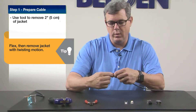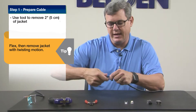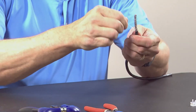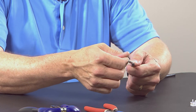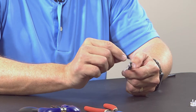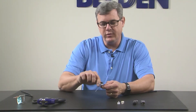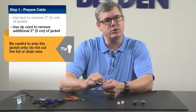You can then flex the cable and separate that jacket. It helps if you untwist the jacket, as that spiral wrap groove tends to grab hold of the jacket to slide it off the cable. With that out of the cable, we now want to use the RipCord. The RipCord will bring the jacket down to an open area where we haven't risked nicking the cable with the strip tool. To ease that process, take your snips and snip the jacket slightly — it'll give you a place to start with the RipCord.